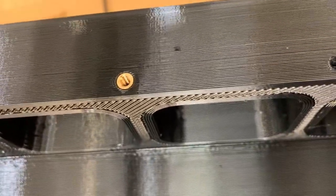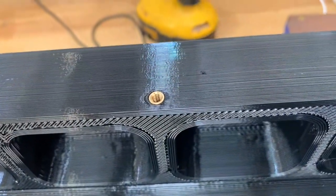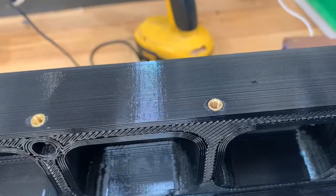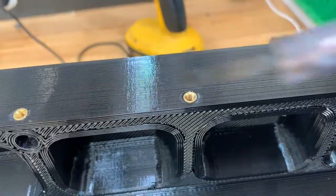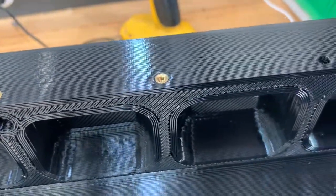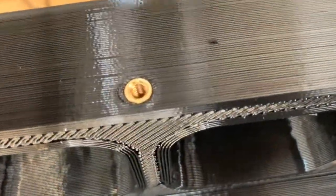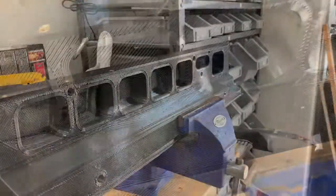The insert is still a little hot, so if I need to adjust it I can. I can put a screw in to check if it's upright, wiggle it into place. There are times where I've put them in really fast, then dropped screws in to make sure they're plumb. In general when dealing with stuff like this you can pretty much eyeball it and you're going to be just fine. Let's just do the rest of these real quick.